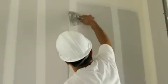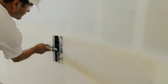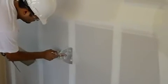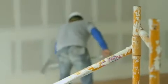The finished side of the shaft wall system is completed using two layers of Sheetrock fire code core or fire code C-core gypsum panels. Its perimeter should be treated with Sheetrock acoustical sealant in accordance with local code requirements. Following these steps will allow you to achieve a two-hour rated system using UL System HWD-0610 for the head of wall and UL Design U415 System B for the field of the wall while eliminating issues with sequencing.